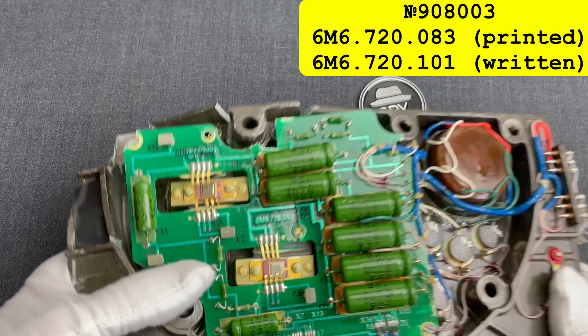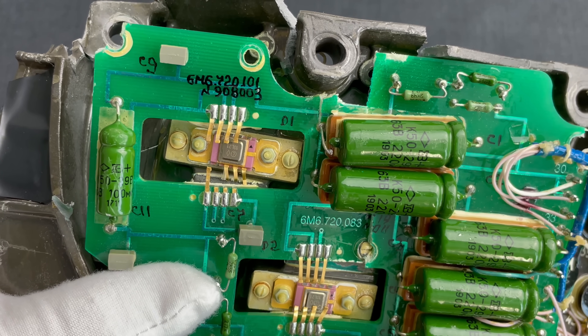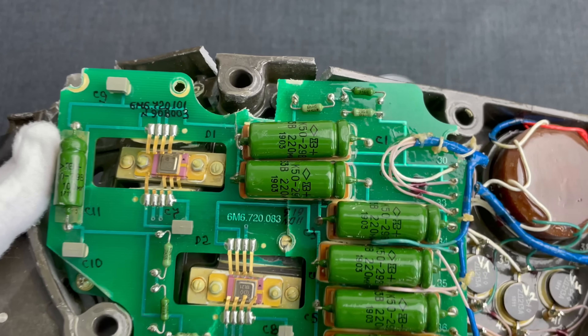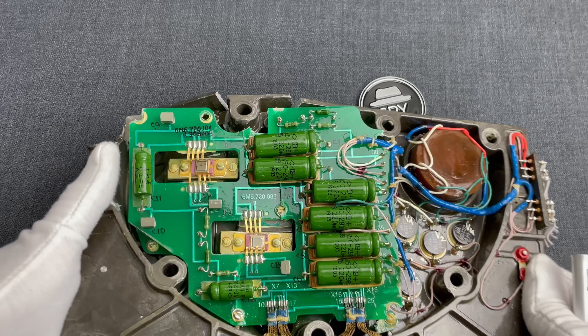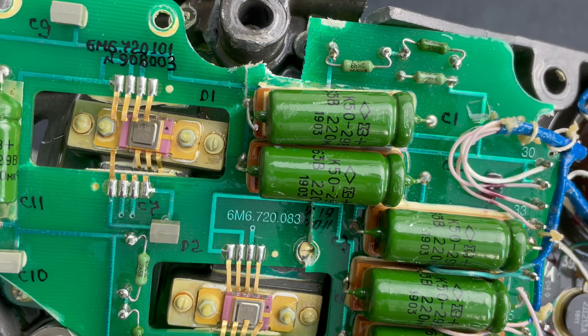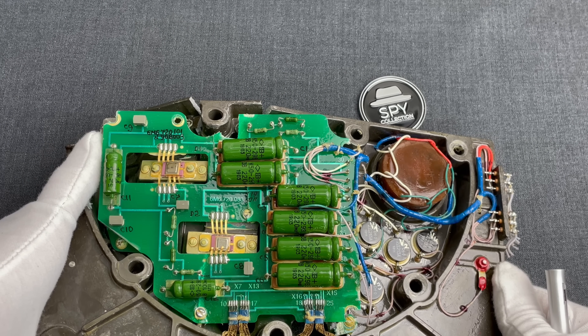Let's look at this — the 6M6 720 083, serial number 90-803. Notice that the serial number of both this and the previous component started with 90. In Soviet times, the first two digits used to represent the year of production, and you'll keep seeing serial numbers starting with 90 in this episode. This opens up an interesting topic: a large, highly advanced weapon system like the S-300, with a history going back to 1978, will usually have a mix of technologies. Some that never required modifications could be literally from the 80s, while others have been upgraded to meet modern warfare needs. Depending on which part of the system you are inspecting during TECHINT, you may encounter completely different hardware designs and architectural decisions.